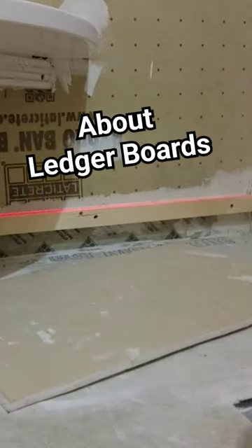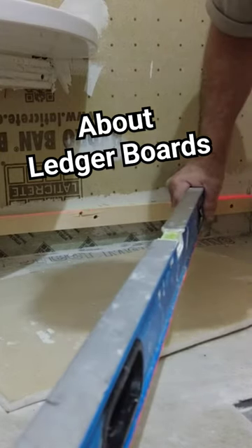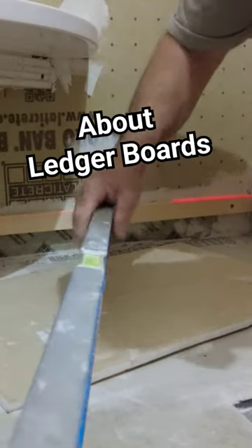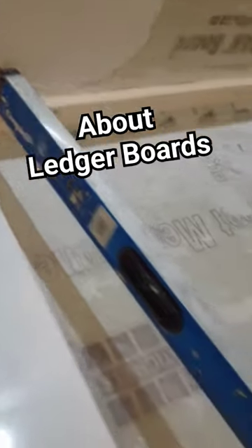Fill it with this set and then hit it with the waterproofing membrane. If you're using hot glue, the hot glue pulls some of the membrane off — make sure you patch it and hit it with the waterproofing membrane again to make sure that you can keep that continuous monolithic sheet of waterproofing on your backerboard.